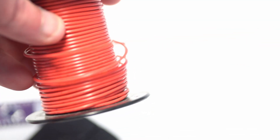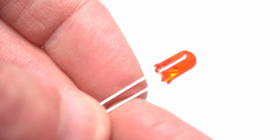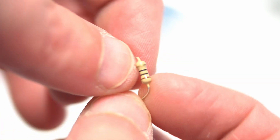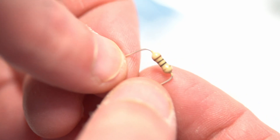Other components that you'll probably need — maybe not in the beginning but in addition to the breadboards, the microcontroller, and the breakout — you'll need hookup wire like this. This is solid core 22-gauge hookup wire that you'll use to connect from tie strip to tie strip to connect certain components to the microcontroller. I use LEDs for output in certain circumstances to test a pin or signify an error condition, so you'll need some LEDs. You'll also need a lot of resistors of different values, and I suggest getting a set that already has a lot of values in it. Resistors are one of the passive components that you'll use in most projects. You'll also need capacitors of various types — I would get a whole set of capacitors if you can, as these are generally used for filtering on signal lines.